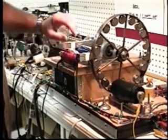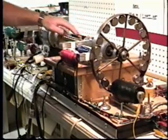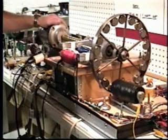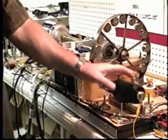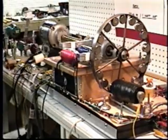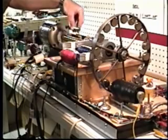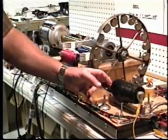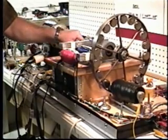We do that by taking the back EMF induced magnetic field from our coil and allowing it to couple through this steel shaft into our induction motor. A quick rundown of the components: we have an induction motor, a brass coupling, steel shaft, steel rotor, and a generator coil. What I will be doing is replacing the air gap inside this brass coupler, which does not conduct magnetic flux, with this steel bar. By doing so we will harness the generator coil back EMF, feed it into the induction motor, strengthen the induction motor's rotor field, and accelerate the generator under load.